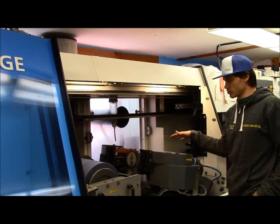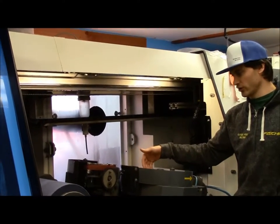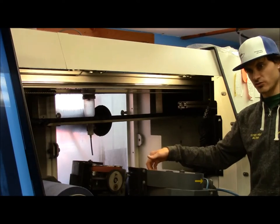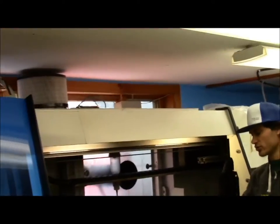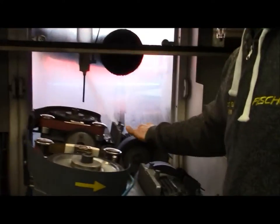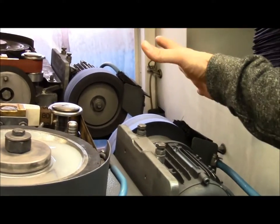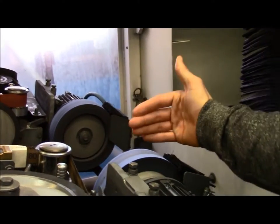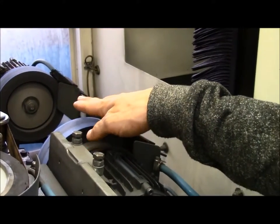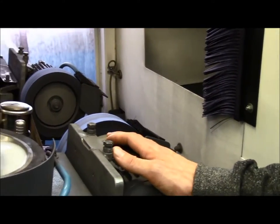This is the edging unit, which is really two edges. It uses a ceramic grinding belt — sort of a high-tech sandpaper — which we use to rough cut in the side edges of race skis, or for a regular tune at the consumer level. And then these HTT discs do a mirror polish of the base edge. Right now they're in the relaxed and fully open position. The machine will actually bring them closer together to do any width ski or snowboard, and it gets a mirror polish on the base finish — what Montana calls their crystal glide finish.